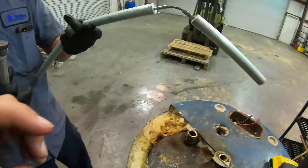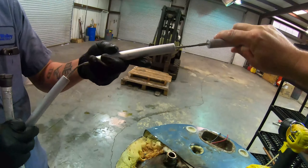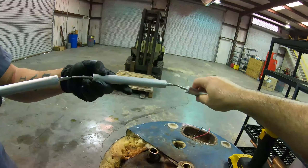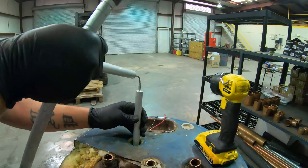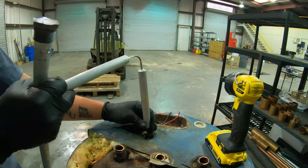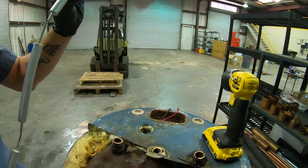Another type of anode rod looks kind of like link sausage. That's because if you don't have the headroom to pull the whole anode rod out, you can cut the old one as you pull it out, and when you put the new one back in, you're good to go. That's just another preventative maintenance we do here at Wally Plumbing Company, and it really works. Most people don't do it because they don't even know what an anode rod is, but it really will extend and even double the life of a water heater if you're consistent about it. Thanks for watching — have a good weekend, see you next week!